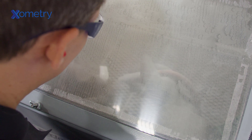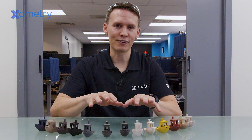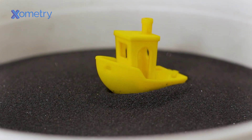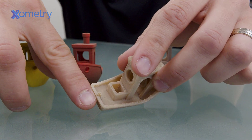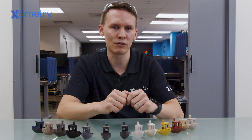I already saw some browning on the polycarbonate. I don't know if that's embedded aluminum oxide or if it's a scorch, but definitely some discoloration. So we used an aggressive media, but we were kind of gentler with how we were using it. First thing: discoloration across every part here — everything faded or got discolored, with this gray media getting embedded in there. If I look at my FDM processes, I did lose some features up front. This polycarbonate piece actually lost a little bit of the flag holder, and even the Ultem has a little bit of rough erosion on that area. Those features would be more fragile in FDM by the layer-by-layer nature of it. The resin-based materials all had very similar appearances and similar effects.